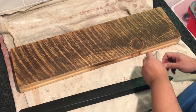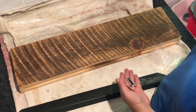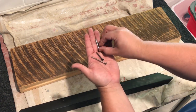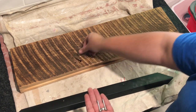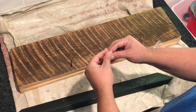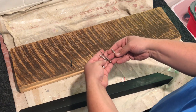The shelf comes with five screws: two for the top and three to support the shelf from the bracket. What I did was get one screw that was a little longer because we added tile, and I wanted to make sure it really held onto the stud in the center. So the two on top are flush mount, I've got two for anchors, and one in the center for the stud.